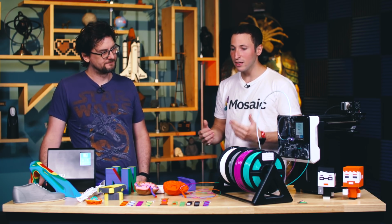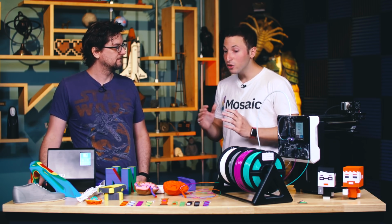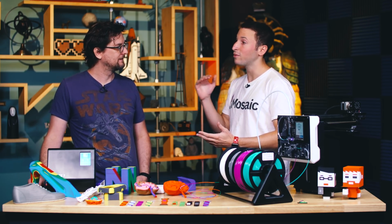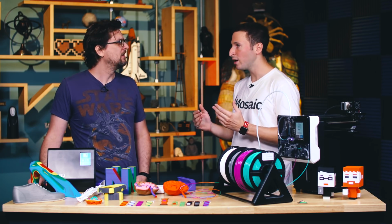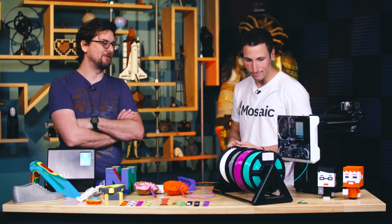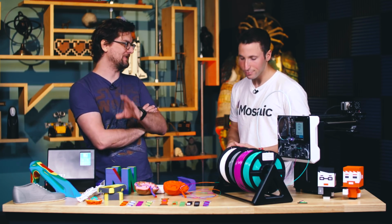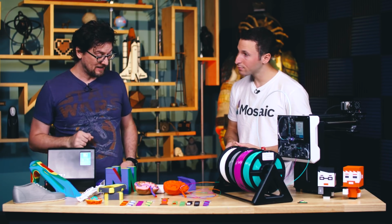Got it. So we try and say keep things plus or minus 10 degrees, and that's your printer's going to be able to handle that. And the good news is a lot of materials companies have tuned their materials to be in that 210, 220 range. Yeah, there's not too many. That's a sweet spot. In general, there's not going to be too many restrictions on what you can and cannot do as far as mixing stuff.